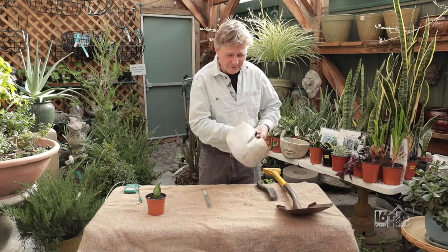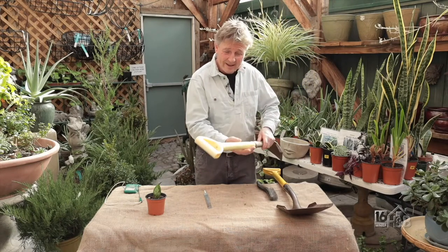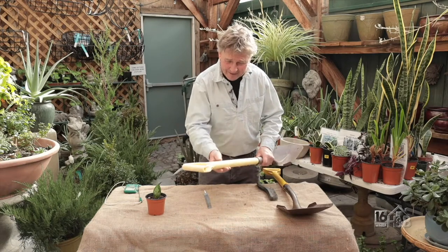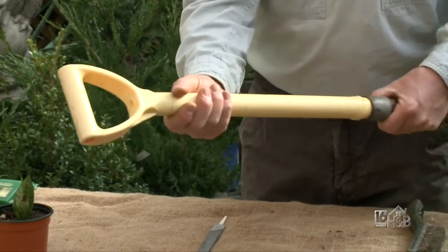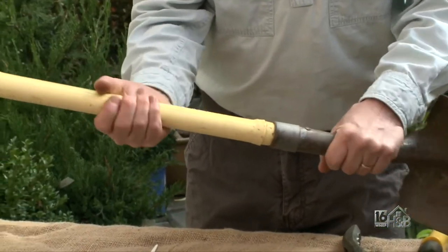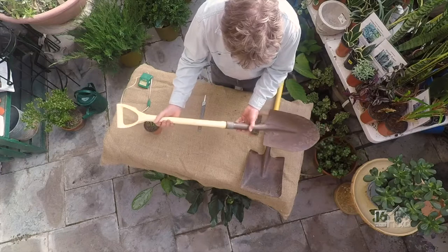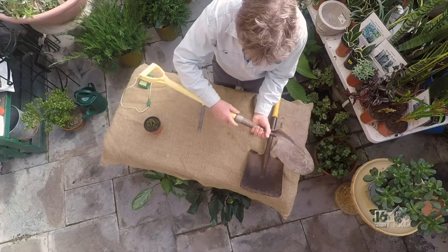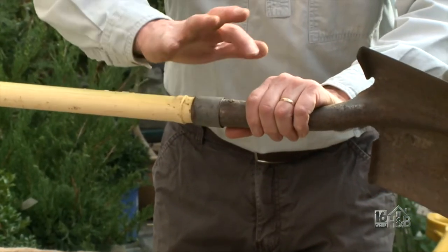I like to check on my tools — this one is not in great shape, but one thing I must show you is this handle. I will go through handles like eating ice cream; they would just break and not last long. But I came across a good old American company that makes a really solid fiberglass handle. Replacing a handle is very easy to do. On a wooden handle, there's a wooden shaft that goes into the metal, and they put a rivet on — you drill a hole, put the rivet through, and hit it so it spreads out.